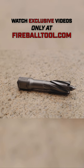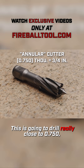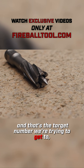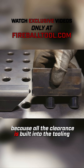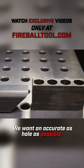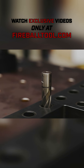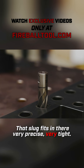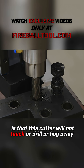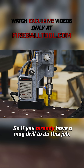Now we're ready to drill our first hole. I'm going to be using this annular cutter to drill these holes — it will drill really close to 0.750", which is the target number. All the clearance is built into the tooling to make these fixture tables work, so we want as accurate a hole as possible. These drill bushings are to the thousandth of an inch — that slug fits in there very precisely, very tight. One cool thing about the jig is that this cutter will not touch or hog away into our fixture because it has a hardened drill bushing.